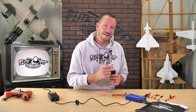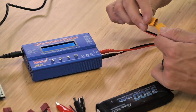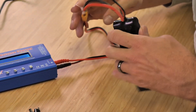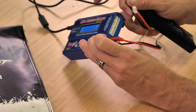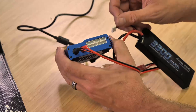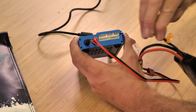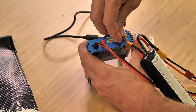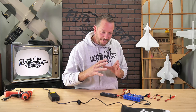So I'm going to go ahead and plug in my battery just like that. Then I take my balance lead and select the balance lead port that lines up with it. We go from two cell all the way up to six cell on our balance lead. At this point, we'd be putting our battery in either a lipo bag or one of our Bat Safes.